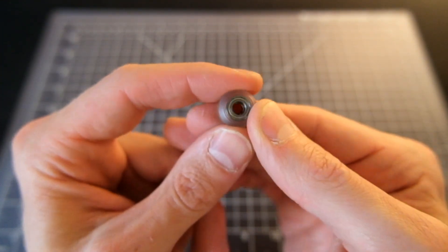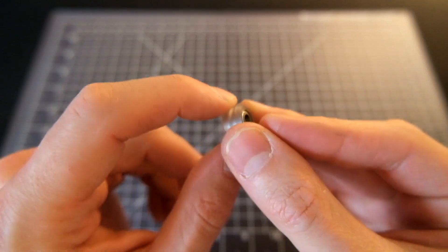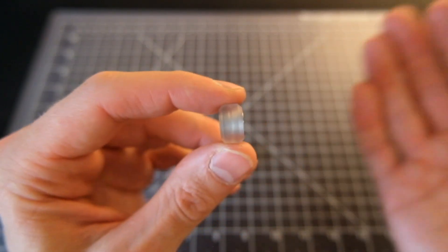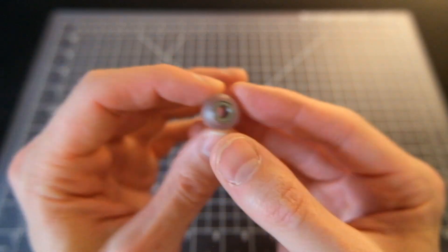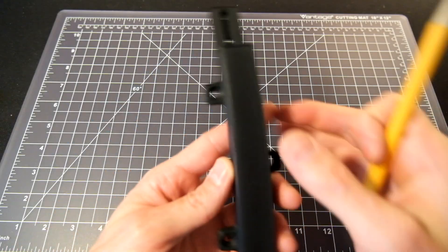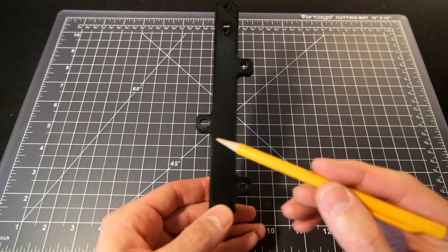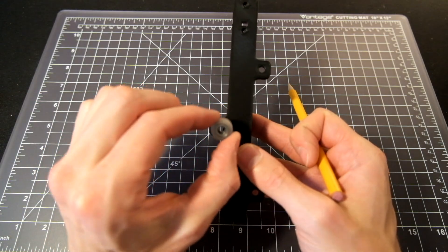I can solve this problem just by using a smaller wheel. This is the wheel I'm using right now from OpenBuilds, and this is actually not the smallest one they make — they have a mini V-slot wheel as well, which is very cute and very small. Here it is next to the original. The decision I'm weighing is whether redesigning the entire counterweight is worthwhile just so I can use a set of these smaller wheels. Looking back on the original goals for the counterweight and the motion system in general, I think it's at least worth a try, because I really want it to be quiet — which it is — and smooth — which it is now that we're using wheels — but we've lost some of that discreet design. I'll save some time here and just reveal that I've already designed and printed a newer version that works with smaller wheels. Visually the main difference is that these tabs are just smaller, and functionally the center point for all the wheels has been brought closer together so that when the smaller wheels are mounted they still hug the aluminum rail.